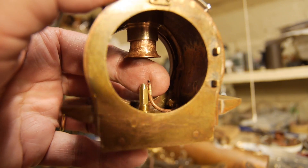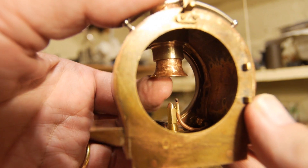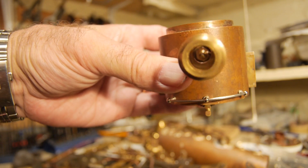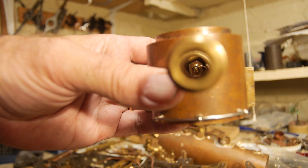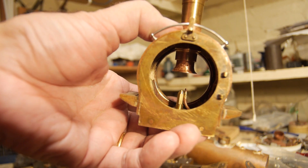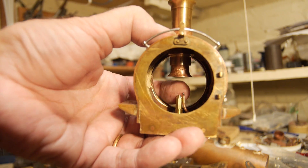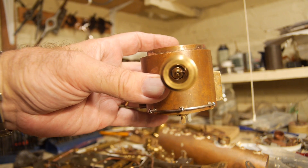You can see the exhaust pipe, the blower pipe, the petticoat pipe. The distance here I'm experimenting with, but there are proportions you can get from various papers on the subject. One of the important things is that the exhaust pipe is centred in the chimney — it goes directly up the centre. As it comes out of that little nozzle, the steam begins to spread out in an inverted conical cone, and that has to hit the sides of the chimney before it exits. That gives you your vacuum.